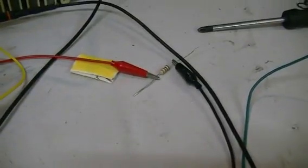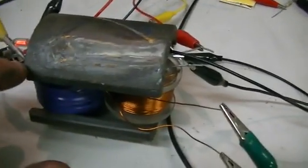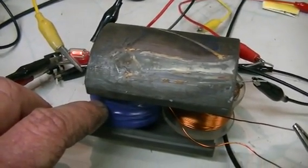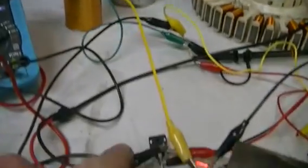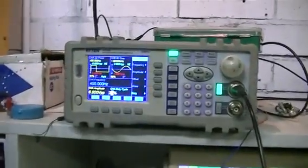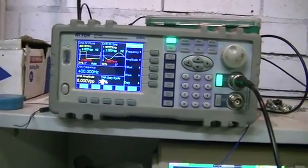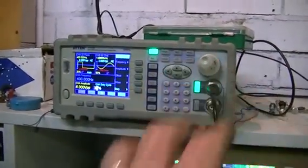This coil here was just another experiment I decided to carry out at the same time - that coil has a 100 ohm resistor on it, and we're not even going to touch that side of the experiment; that's going to be for something else very interesting. Our primary coil is being fed four volts at the moment, switching it on and off via a transistor that is being switched by my signal generator at 400 hertz, 31% duty cycle.